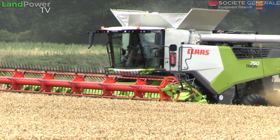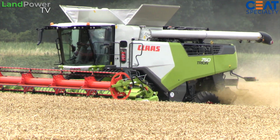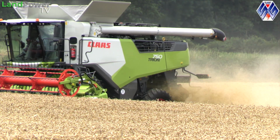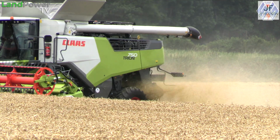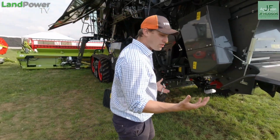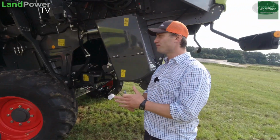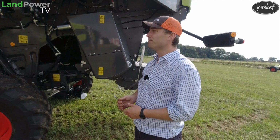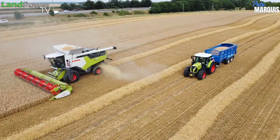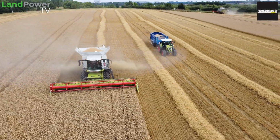And it's just probably more using new techniques, thinking smarter than actually redesigning something. If you've got a product that works and you know works well in your conditions, for example, the 600 millimeter threshing drum works very well. The synchronized concave adjustment, hydraulic concave overload protection, synchronized drum drive, things that work well have not been forgotten about. They've been put in and are liked by our customers.